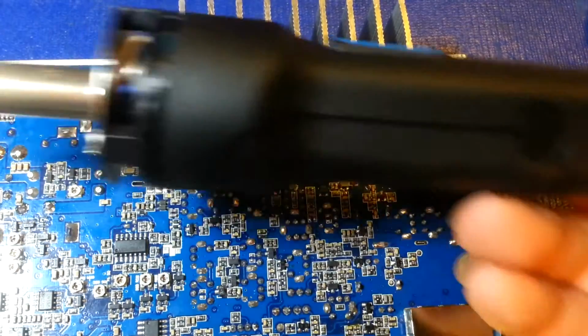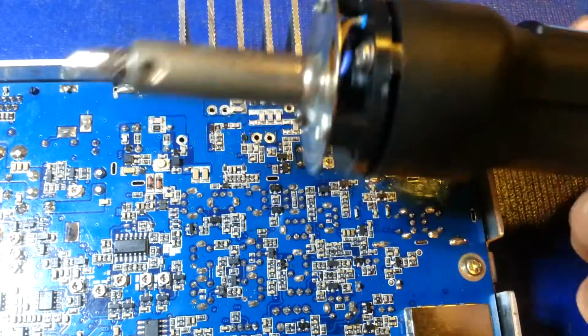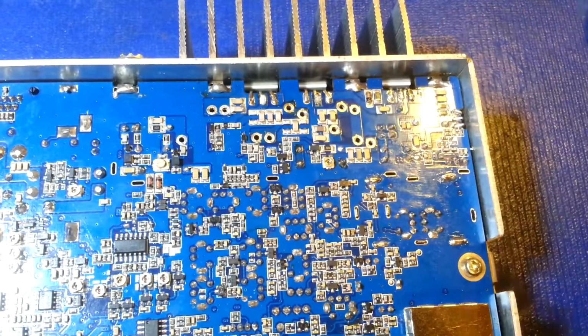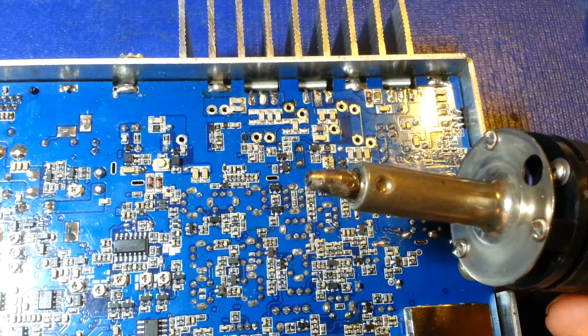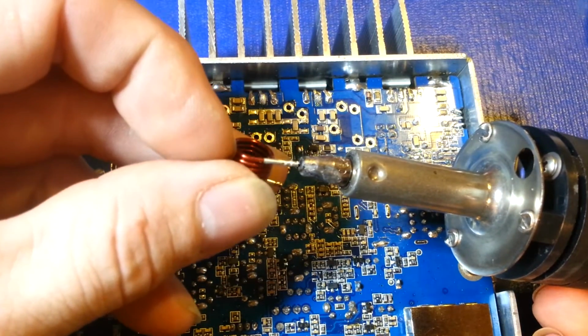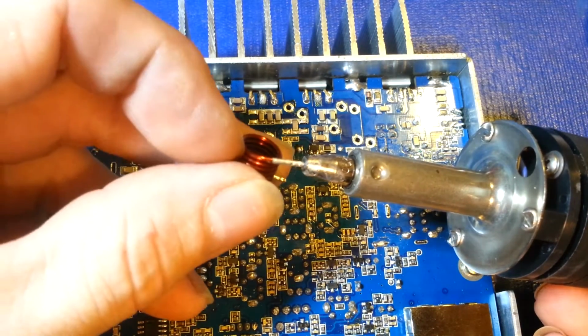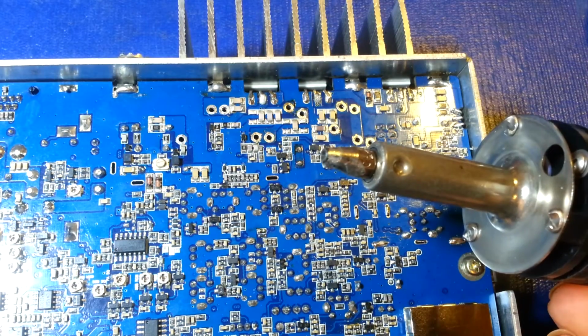using a proper desoldering iron. Okay, and we're using, right here, vacuum-operated. And of course I had to stick my big monster hole tip one, so that's another thing when you're using these, always use properly. Trying to do that through the camera is not working very well, but you can see properly sized for what you're desoldering.